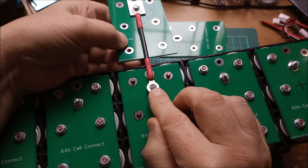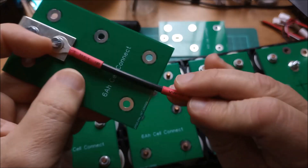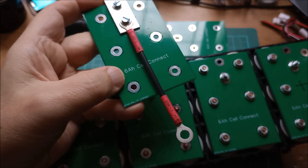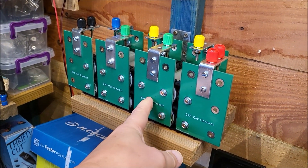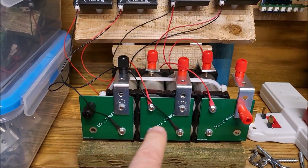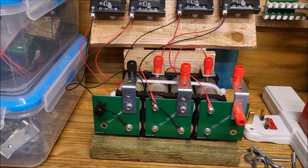So that can be bolted on there. On the other battery I've got two wires coming across — they weren't as thick as this wire. This is much thicker wire, it's 12 AWG — mustn't short that across two lots of cells — good for about 40 amps. So back to the shed, because I need to get these part batteries I made up. I want these boards with angle brackets on them, I need more cells, more cell holders. There's another earlier version here which had the volt meters on it, so I need to rob the holders and the cells to complete my 8s5p battery.